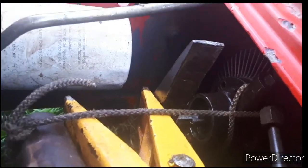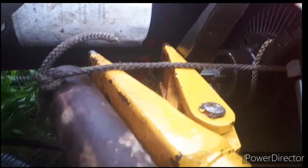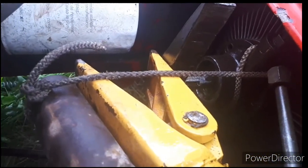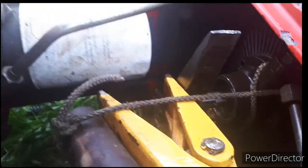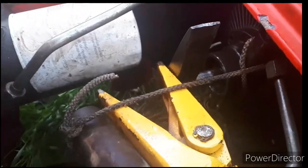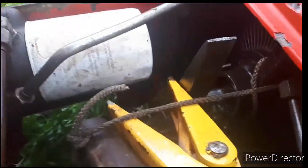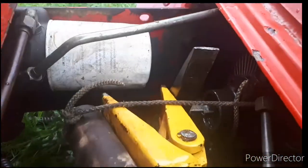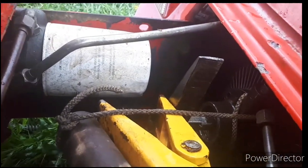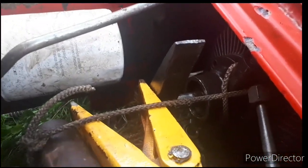I've tried it probably 30 times now. As soon as I start to load it up, it just turns sideways and goes, and it should already come off with the amount of pressure I put to it, but it hasn't even budged. And long before I even started to disassemble this thing, I had soaked all the joints on the drive shaft and this bearing in preparation to take this apart. And then I've been soaking it ever since I started taking it apart. And it hasn't moved.